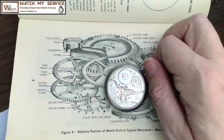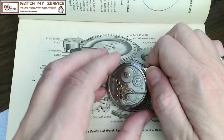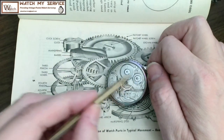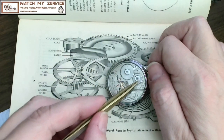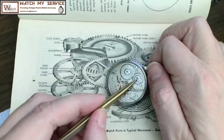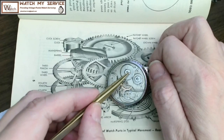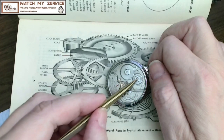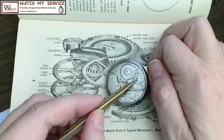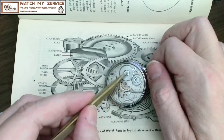So, when I get this, I look at that and I determine whether it's connecting properly, and it's doing that. So, it's winding properly. I also look to see if the screws here are tight. Usually the screws on the crown wheel are reverse, depending on the configuration of this wheel, but they're usually reverse. I think when the ratchet wheel is on this side, this ends up being reverse, and if it's on the other side, it's not reverse. But again, correct me if I'm wrong, but when I remove it, I test it very carefully so I don't ruin anything here.